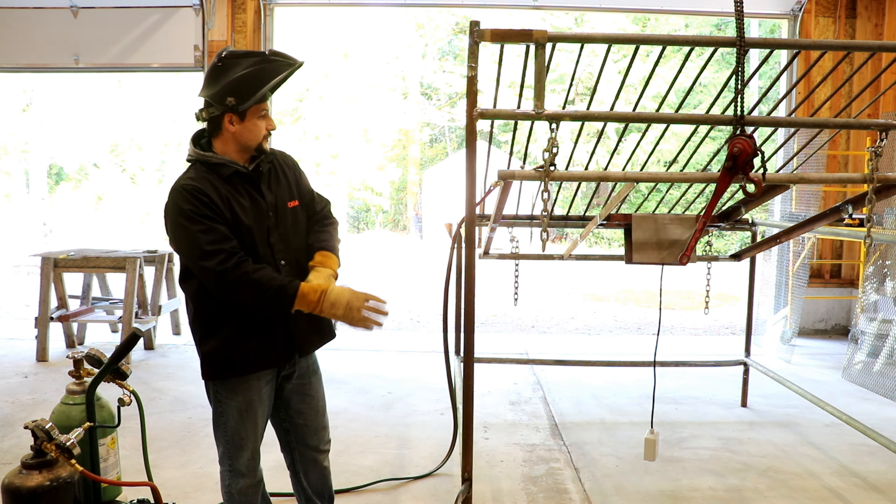Just know that you should have a grounded plug. This plug is not grounded — I cut this cord off my Ryobi grinder because the motor burned up and it's not worth replacing the brushes. Most corded power tools nowadays are double insulated, which means they don't need a ground plug. This motor is not double insulated — it has a metal case and the wiring is inside, which means it requires a ground plug.